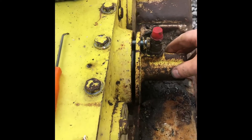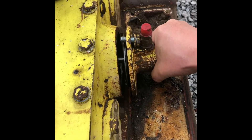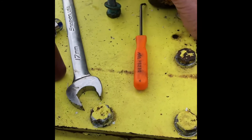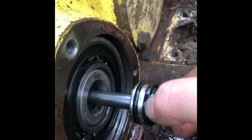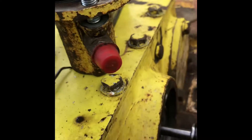We're going to use anaerobic sealer on it so it'll be easy to get off next time and it'll seal really well. To check your piston or cup seals on your Ammann compactor, there's one on either side. It's a nice design - it's an O-ring seal. There's an O-ring and a cup seal, and these ones are in good shape. This machine is an O5 and it's got a lot of hours. Another good thing to check is to make sure that the small bearings inside move freely. These are probably like the Wacker compactors where they're oiled by the rotating oil in the sump. Just clean up the O-ring groove, put some new grease in it, some blue Loctite, and put the bolts back.